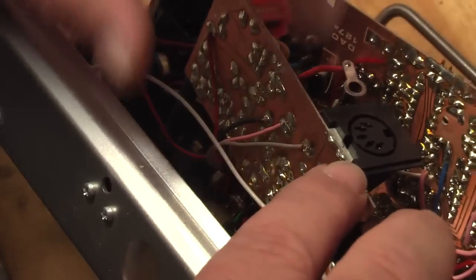We're going to leave this board in and disable it by just pulling the crystal. We did a quick current measurement — with the crystal in and everything transmitting it's drawing about 200 milliamps. When you pull the crystal that drops down to about 70 milliamps, so it's disabling the RF part of the board. Once we get the 2.4 in there we'll probably be pulling less than 100 milliamps, and on a 2,500mAh battery — do your maths — that's loads of hours.